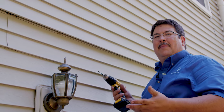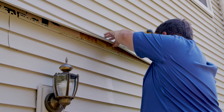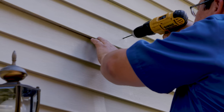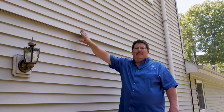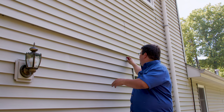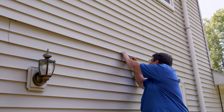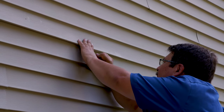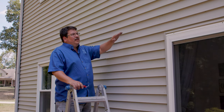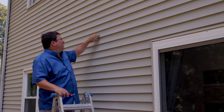Hopefully you're okay with drilling into the vinyl siding. If not, you need to come up with a different system. We're going to drill a small hole first right where we know that stud is. We have the location where we want to install the eye, and I'm going to drill a bigger hole — but first let's put this vinyl siding back on. I'm going to take my tool to where it starts to unclip and pull it down and push it into the J-clip underneath. I can see my hole at that end in this piece of vinyl siding. So this is what I want to remove, but my seams are way over on each side. So I'm going to start in the middle and insert my tool here and pry this out.